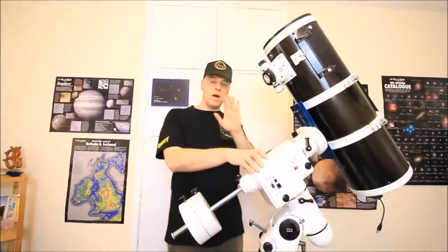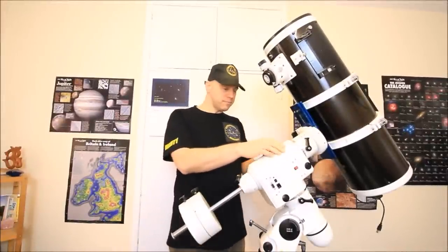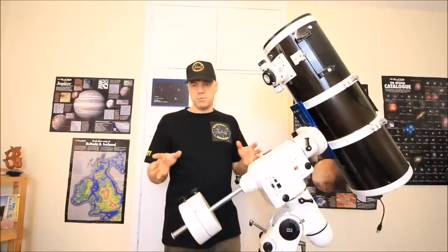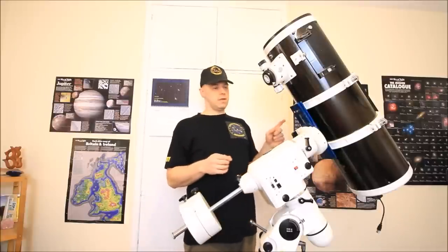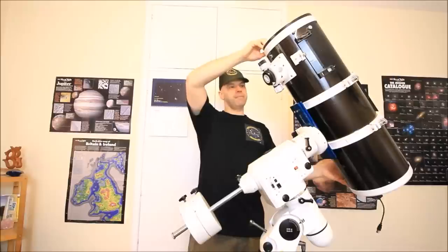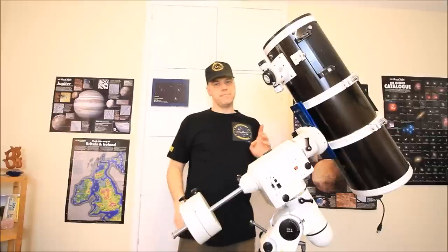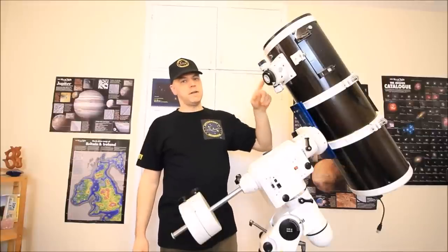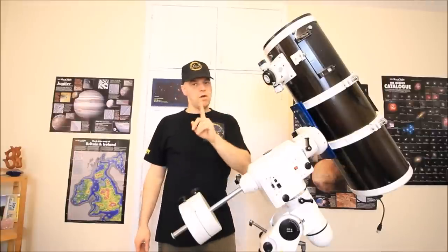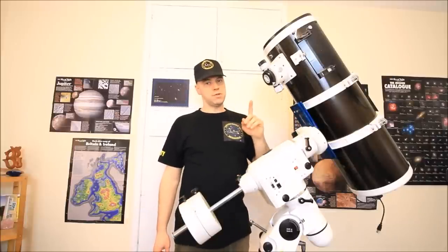Even though you have adjusted it in part 4, as you followed that video guide, you may think everything's running smoothly. So, just to prove one thing, as you can see here, I've still got the dreaded free play, which sort of put me off a little bit. As you can see, I've still got that 5mm play in the declination axis. However, I've now figured out what the main causes were.